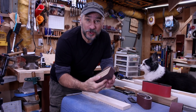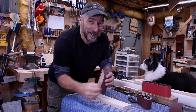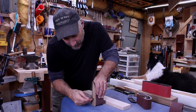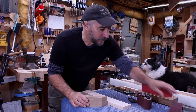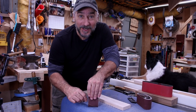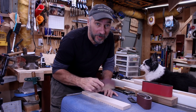I'm interested in my sanding block — you mean this spring-loaded locking mechanism sanding block? All you gotta do is put a nail in there to lock it down, take out your old sandpaper, replace it with the new one, and you're on your way. If you're interested, stick around — I'll show you how to build one.